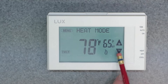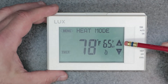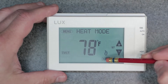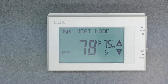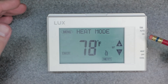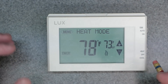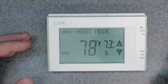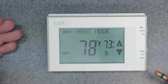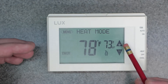Now we're going to have just two buttons here — it's a very simple display. It removed a whole bunch of stuff from the display that was previously available. Now we simply dial in 75 and hit next. It's a simple two-button operation. We can come down and go to 73 — you don't even need to hit next; it's going to automatically lock that in. So it's a simple manual-style two-button thermostat. No more programming needed, and it's as simple as can be. It's nice that you can turn this into a manual thermostat versus having to deal with programming.